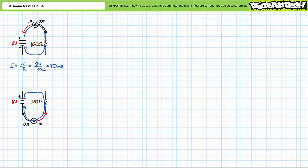In both scenarios, the ammeter is a single point in line or in series with the element of interest. An ideal ammeter acts like a zero ohm resistor through which substantial current will flow and the presence of which will not influence the circuit in any way, shape or form. In reality, an ammeter has an extremely small resistance and will subtly influence the circuit under inspection. For now, let's assume an ideal scenario. We'll examine instrument loading effects in later lectures on series-parallel DC circuits.